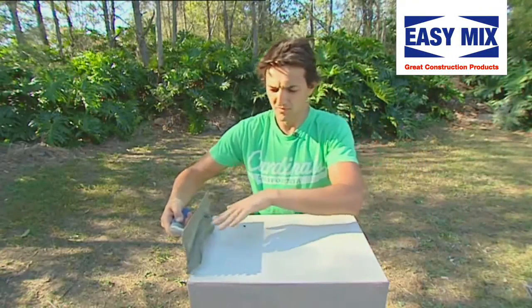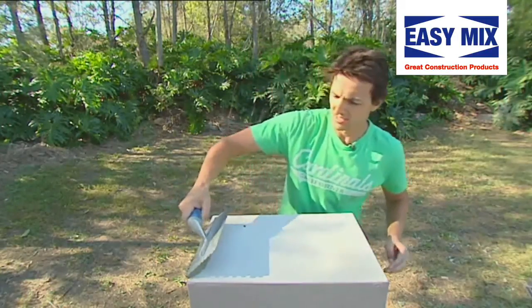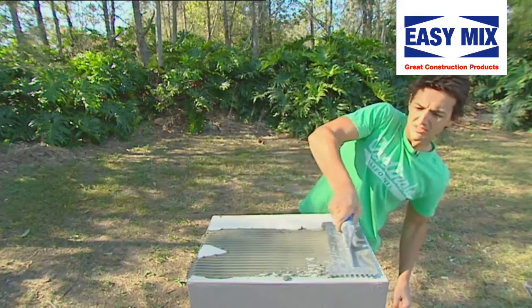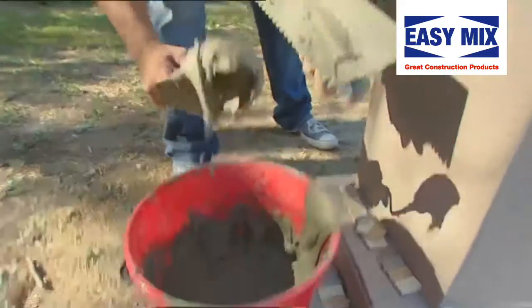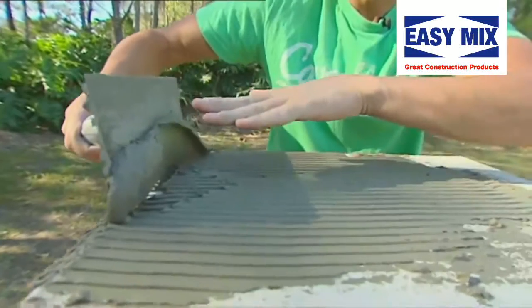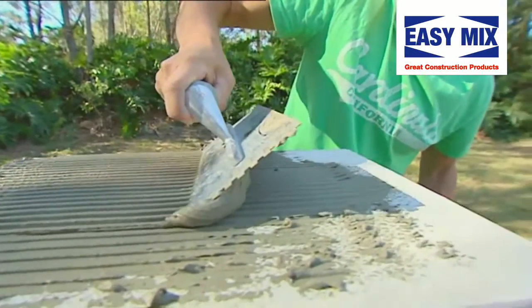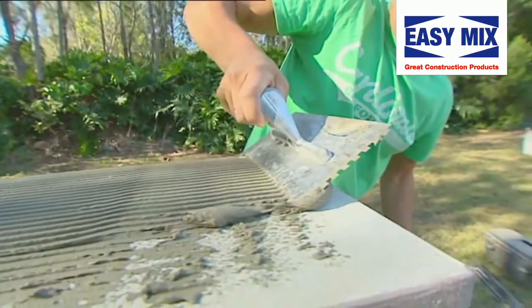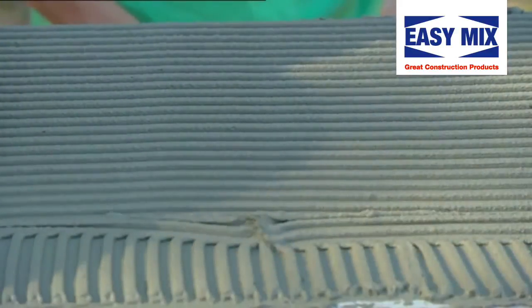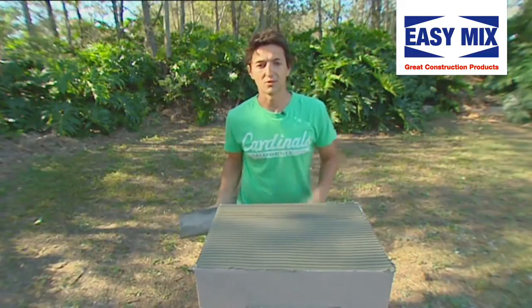And then try and work from the edges in, edges in, so you're not pushing adhesive off the sides. Get about a 45 degree angle. Some nice even pressure. Smooth that along. Now, unlike the render, where you bring the angle progressively down, you want to keep a 45 degree angle all the way. Nice and even and firm. Beautiful. All right, let me throw down our tiles.